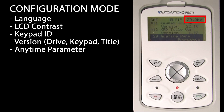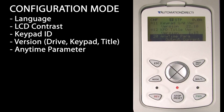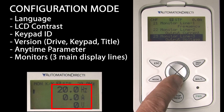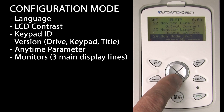The any-time parameter is available at any time in any menu. Right now it is showing the frequency, but if I enter it we see there are lots of things you can put there – let's show the output current. I especially like that the units show up automatically with it. Monitor lines 1, 2, and 3 are where you select what shows up in the main display. Monitor mode init resets those LCD monitor items to their defaults.